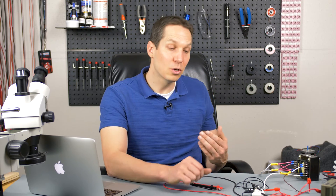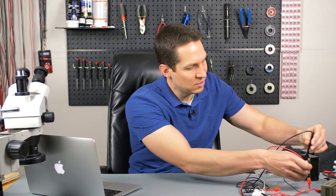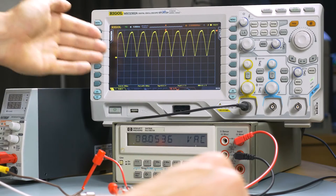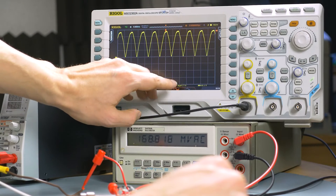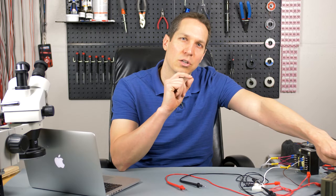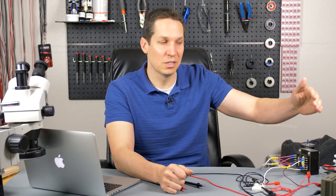That's why you almost never see half wave rectifiers in the wild — they're just so inefficient. So let's run over some of the numbers. Using my multimeter measuring AC voltage, it's reading 13.4 volts AC. And then looking at the output across the load through the full wave rectifier, the average is 11.7 volts. Since we lost 1.4 volts, 11.7 plus 1.4 is 13.1, so it seems like our diodes are actually dropping a little bit more than 0.7 volts forward voltage drop.